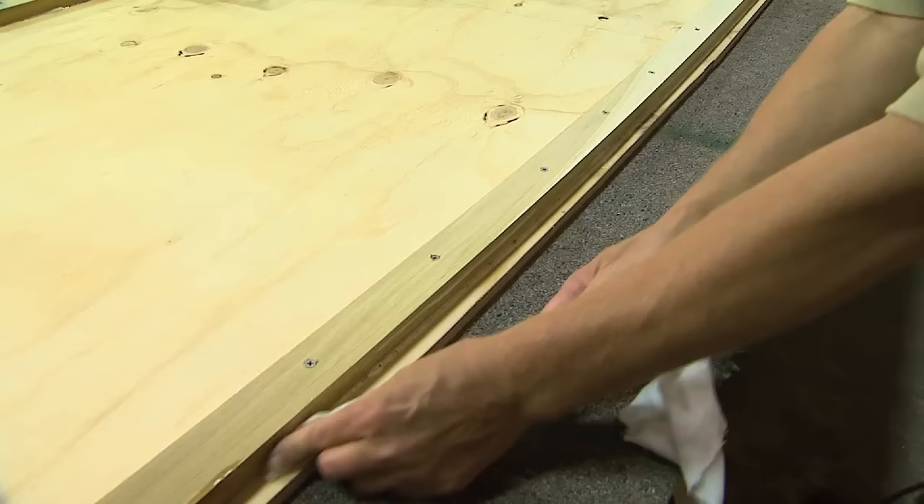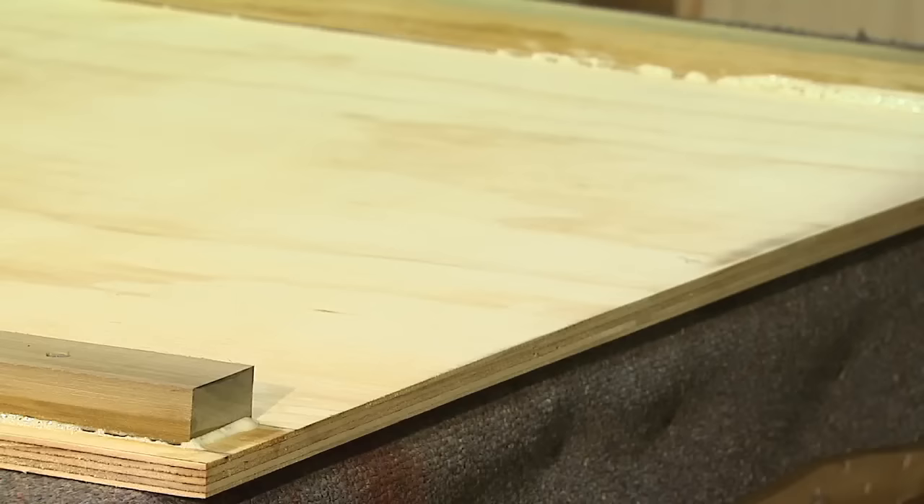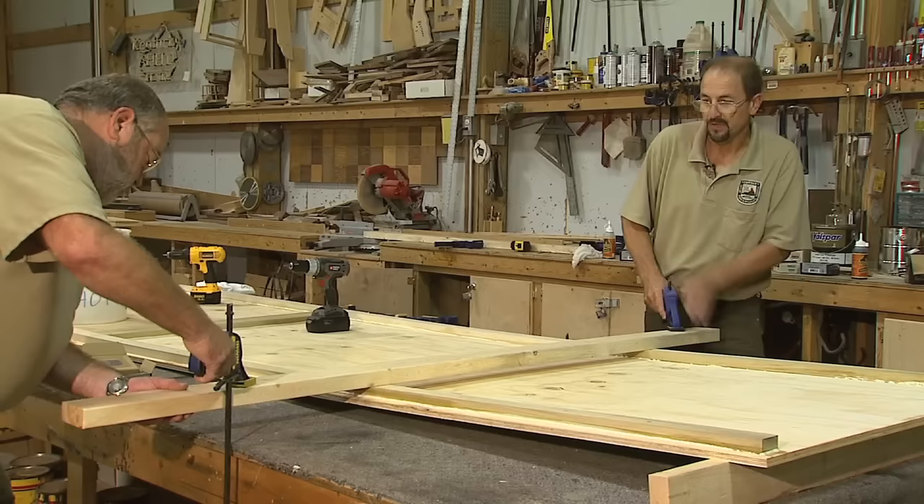You've seen us wipe this down once already — now you see it's continuing to foam. It's the exterior of the outside of the boat where you're going to lay and apply that side rail, so you want to keep it clean as it foams out. We've set a tube underneath to give us a pre-arch while this is still drying, and we're going to draw down the secondary part in the back so the glue dries with this in an arched position — which is what it's going to be like when we put our side rails on tomorrow.